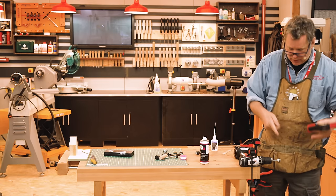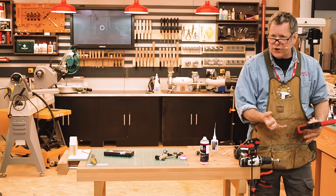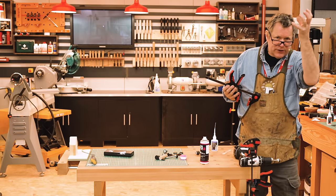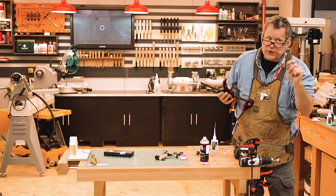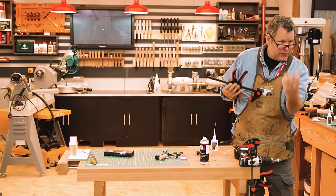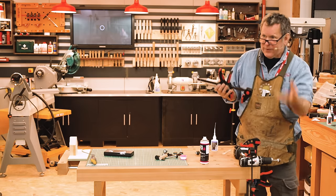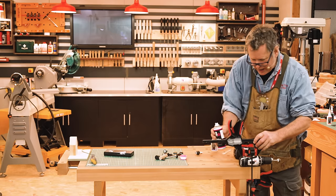Okay, so that's what I'm kind of doing here. If there's any acidity on the surface, I'm just kind of helping it cure. And if I put too much CA, a big thick bead, and I accelerate it from the top, I'll cure the surface, and then it has to sort of migrate down. You can also trap the gases, which can actually slow the CA cure down. So if I cure it from the bottom up, that's what I'm doing tonight, that's a better way of doing it. So I've kicked this, it's sort of dry.